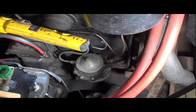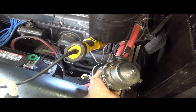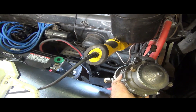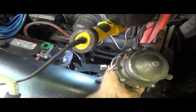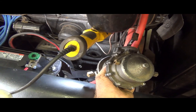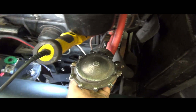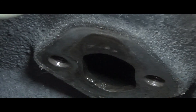With a lot more effort than I wanted, the lines are disconnected. By far the hardest job was getting the lines off, mostly because the battery box is in the way. I really didn't want to take the battery out, so I wound up doing short wrench turns to get that little fuel line off — not much room to work with. You almost have to do it top side because there's too much frame in the way. Fortunately, the two mounting bolts came out pretty easily.